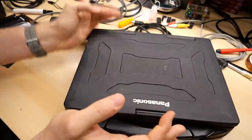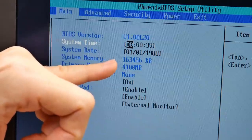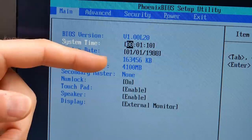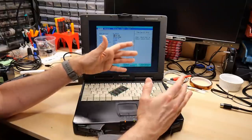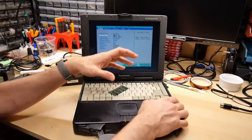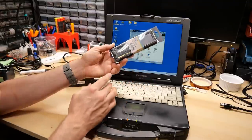What I really love about this computer is you don't have to worry about throwing it around — this thing is tough as nails. Power it up — F2 to go to setup. It still says 160 megabytes of RAM. That was definitely the 256-megabyte SIM I installed, but it's not being recognized. Zed mentioned in his email he had a 512-megabyte SIM he was going to send as well, but he didn't think it would work. Well, even the 256-megabyte one doesn't work either — that was a total bust. I'll take this memory out and put the 128-megabyte SIM back in, which I guess is the maximum memory for this computer. Thank you very much Zed for sending this — I'm really sorry it didn't work in this machine.